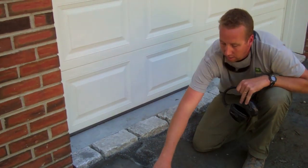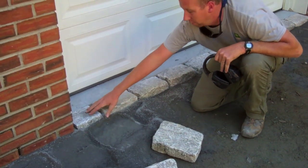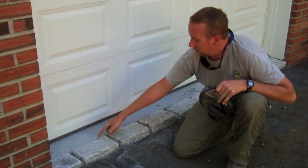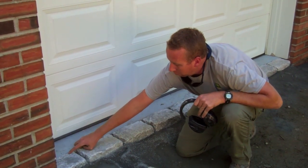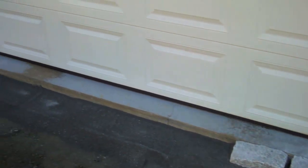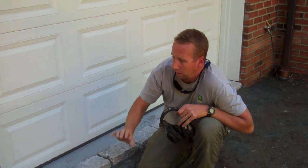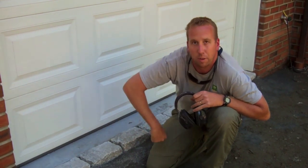In this case, it doesn't, and a normal jumbo cobble is too wide for us to fit in that gap, and some of the other options were too small. So we went ahead and cut these, which works to our advantage because now we get a nice, clean connection between the concrete and the cobble. We're going to do this first along each of the three bays of the garage, setting them in the stone dust, pounding them down as we go, and then we'll be set to run our pattern, which will be a running bond. So we're going to continue moving down each of these bays, and then we'll start setting up our pattern.